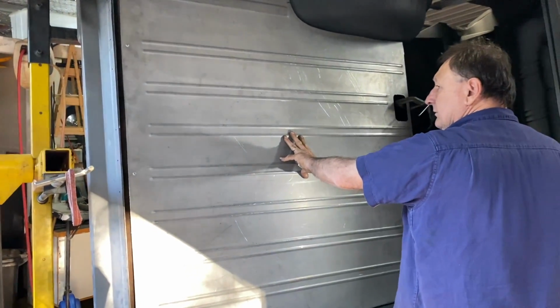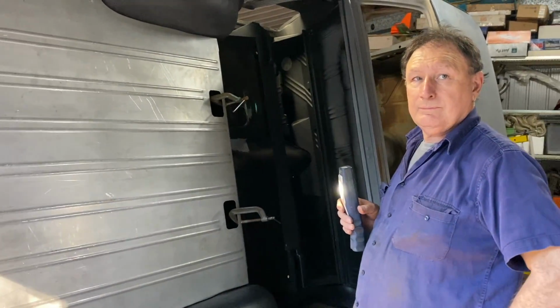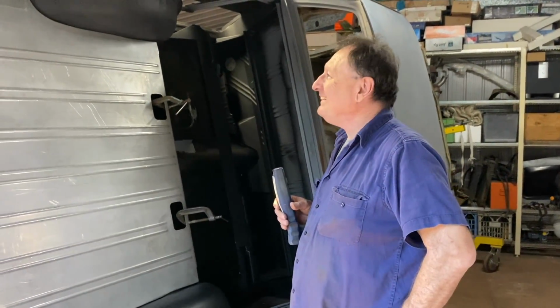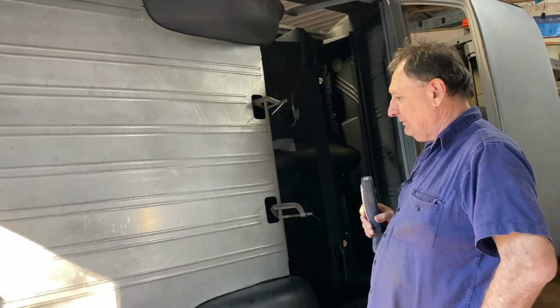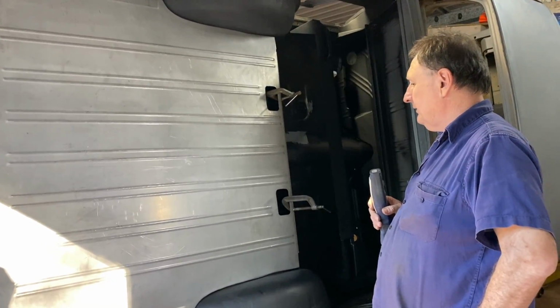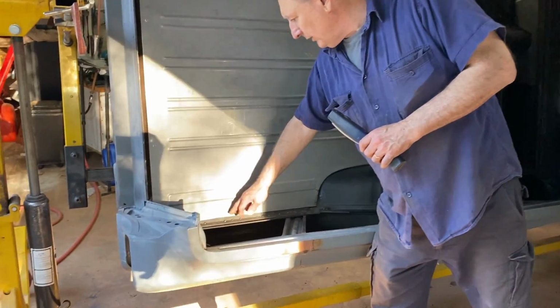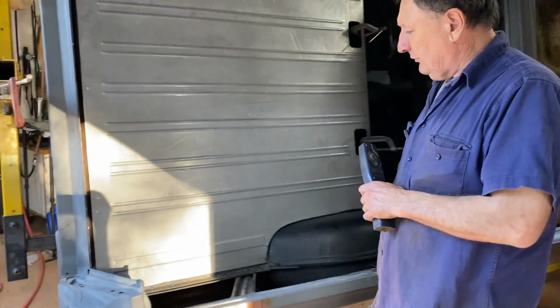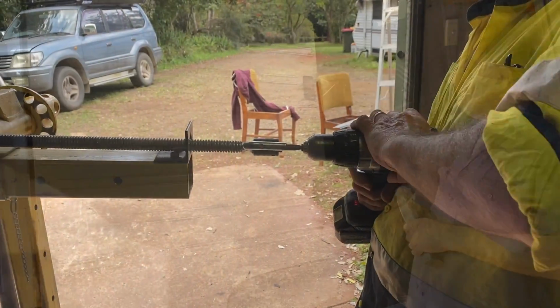I personally, if you're going to make me weld this, let's stitch it from underneath. Well, it's just to get a better finish, won't we? We'll get a better finished result. And that's something I really like. No grinding at all. Oh, a little bit here. But you're still welding that from underneath, so you'll have almost no grinding. We don't have to grind the top of the tray.